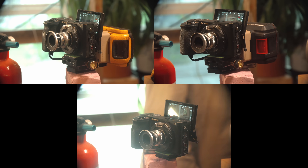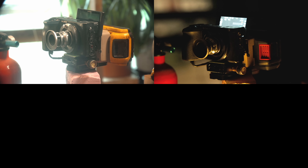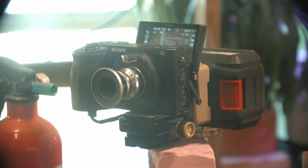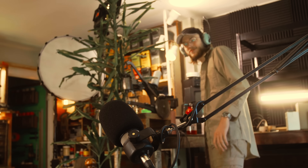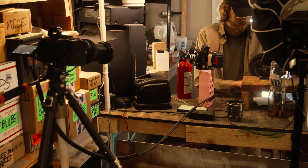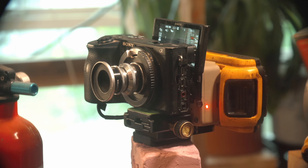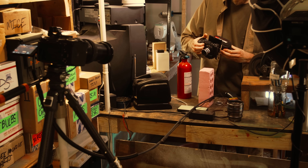I set up a test with my two sizes of batteries versus the stock Sony battery, all with normal settings constantly recording. The stock camera went for 3 hours and 11 minutes. On my DIY adapter, the DeWalt 2Ah went for about twice as long at 6 hours and 2 minutes. Then the Bauer 5Ah battery recorded all the way through the night to the next morning, continued until hitting the Sony record limit of a 13-hour clip, at which point I cleared the SD card and continued rolling. As I was recording this voiceover, it was still going — almost at 15 hours. It literally just died while I was setting up a shot. The grand total was 15 hours, 18 minutes, and 13 seconds. I've been monitoring temperatures throughout — the most I saw during the 6-hour DeWalt test was 85°F, and right now during the long test I'm seeing 91°F at peak. I'm very pleased with those results.